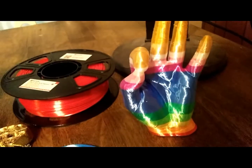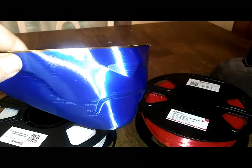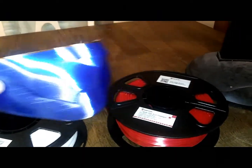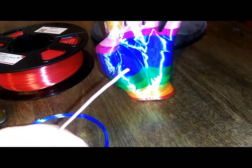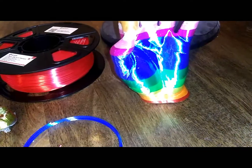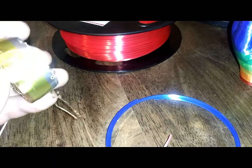They're just beautiful. I don't know if they're worth the price, but if you're wanting a super shiny finish in a specific color and don't plan to paint it, this is the perfect filament. I haven't had any problems with it besides that one fail — and that was my fault. With a Bowden extruder you straighten out the filament end and square it up, then follow behind with the new piece and send it through. I was in a rush, it jammed, and that's why that print failed.